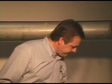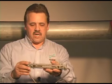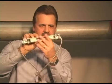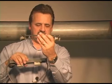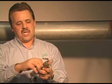Okay, now I'm going to opt for the single mounting solution here to demonstrate to you. Here's the track assembly completed with the transducers mounted in. It comes apart into two sections. This is the base section that installs to the pipe, and the transducers will then come over on the top. If you have to remove a transducer because you're going to use a second track, if you remove this screw here, the transducer will come straight out with the mounting hardware.